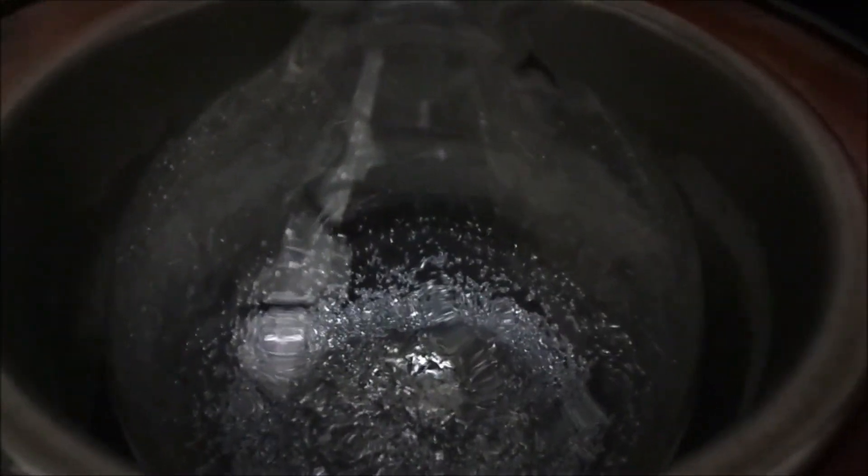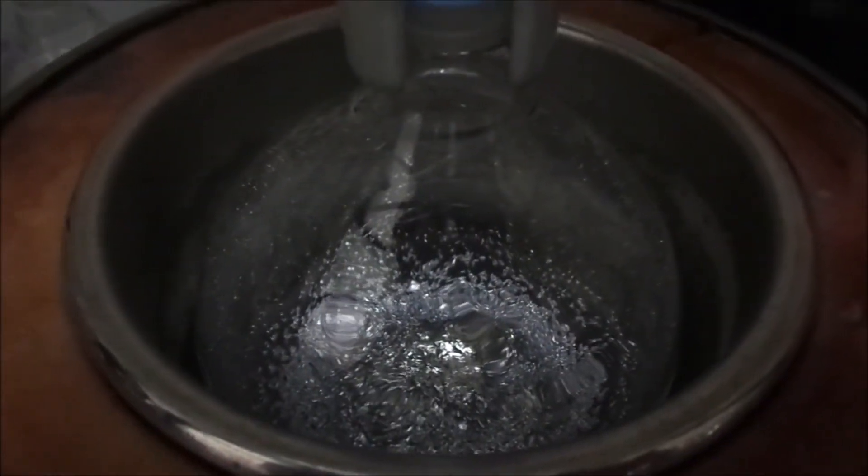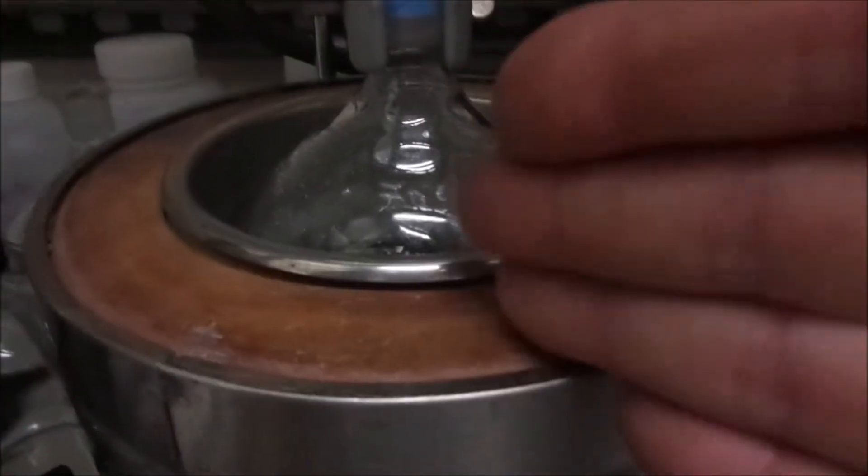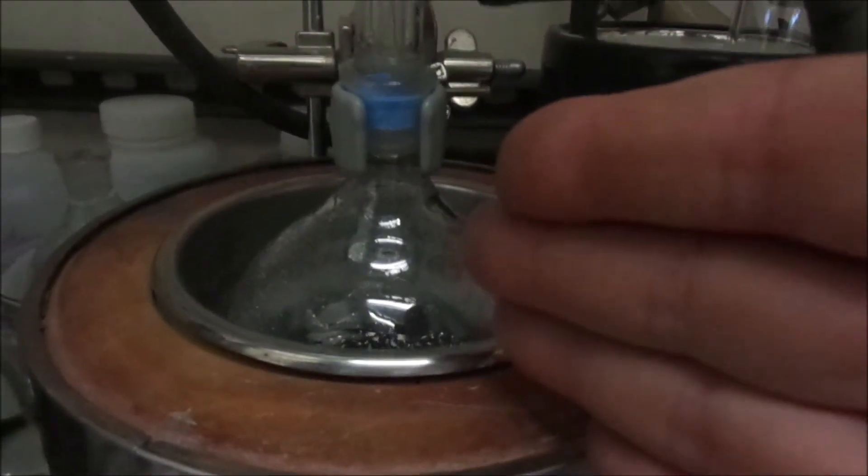This is working really well with the fan. Condensation is building all through the distillation tower — that's what we want — and we're getting it to drop out. It's going to be a slow process; that's part of having one of these towers on here. It does slow things down but you get a much purer fraction coming out, so the mercury will be much cleaner on the other end. Our collection vessel is in a cold trap — dry ice mixed with ethanol at negative 78°C — to trap any mercury vapors that might make it through. As a redundancy we also have an additional cold trap, which was actually a bubbler, down to the pump filters.